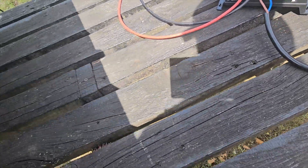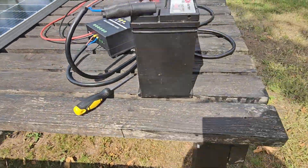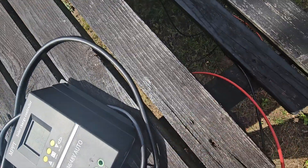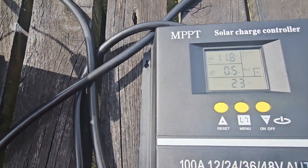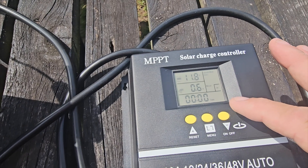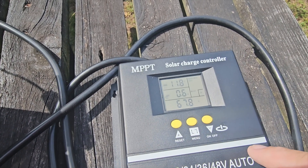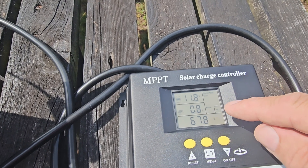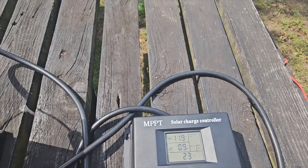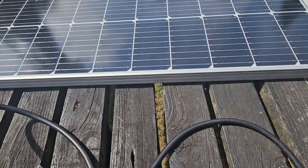Battery's connected. Let's flip the panel over and see if we've got any action — we're under a tree a little bit but we'll see. Let me move it around for better sun exposure. It's creeping up from the solar panel: 0.6 amps. There's a menu here — that little one says power. 11.8 volts. We've got power coming in, up to 0.8 amps... 0.9 amps. That's not bad considering the sun is quite hazy.